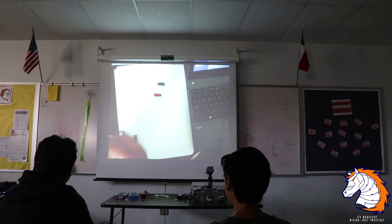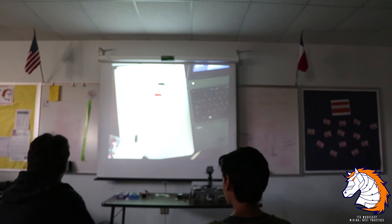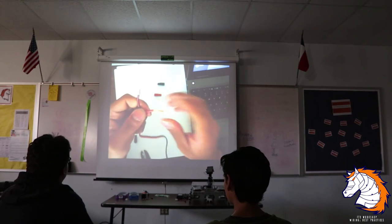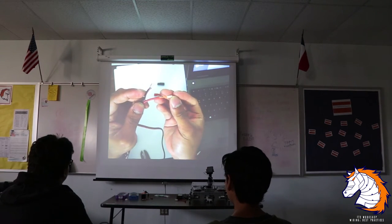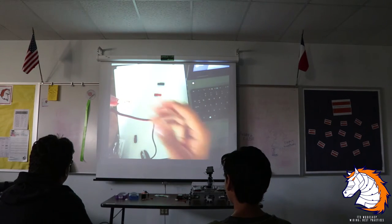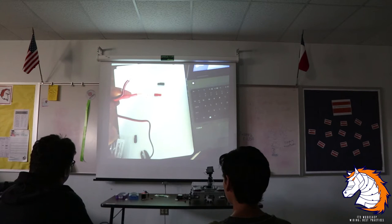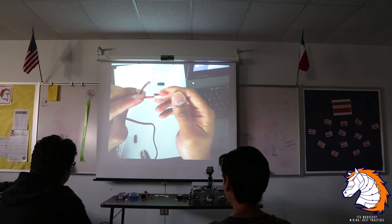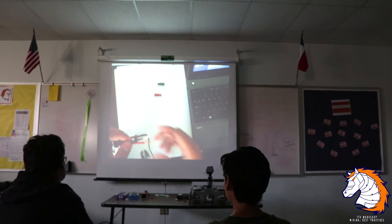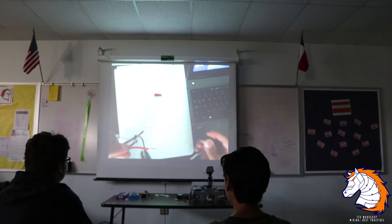It takes a lot of practice, but if you're patient you should be fine. If the contact is sticking out too far it becomes a safety issue — you can short the wires, which will blow a fuse. Always make sure it's tidy and neat. If you don't crimp it properly and put it on the Anderson Power Pole, it doesn't work, doesn't lock, or becomes loose.